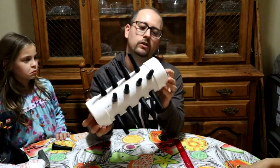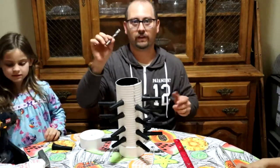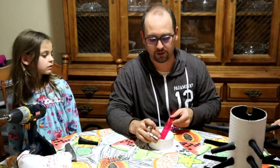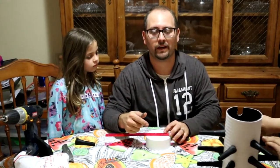The next step is to drill holes in the end caps. I'm going to put a hole right through the middle of each of these end caps using a 5/16th drill bit, as dead center as possible. It's really, really important to get exactly dead center, so I'm going to measure four inches across, draw a line, measure four inches across again, draw a line — keep doing that until the lines cross in the same spot. If it's off center, it'll wobble, and that makes it harder to pluck and hard on the drill — it will burn it out if you're spinning an unbalanced thing.